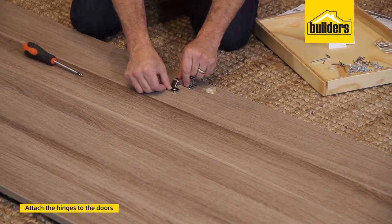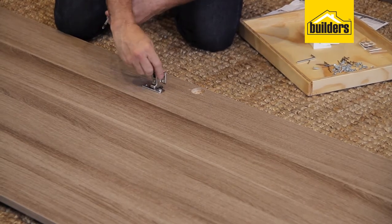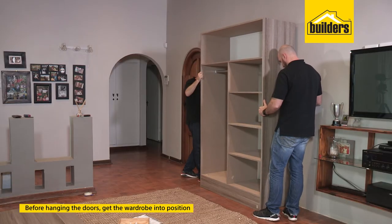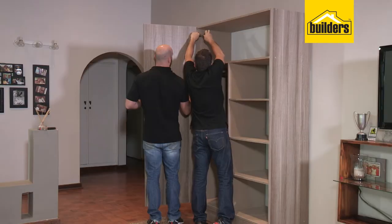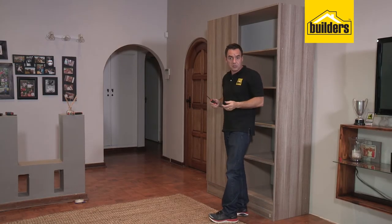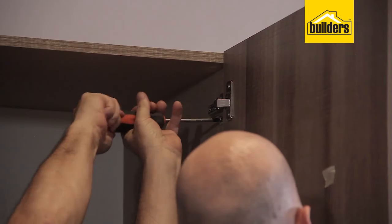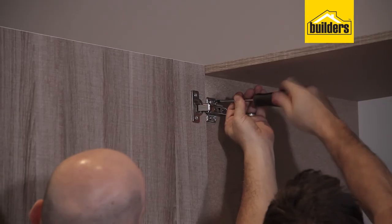It's now time to put on the doors. First, insert the hinges into the doors, pop in the 16-millimeter screws and secure the hinge down tightly. Before putting the doors on, it's a good idea to get the structure into its final location without the excess weight of the doors. Fitting the doors can be quite tricky due to their size and weight — make use of a second person to hold them up into position while you align the screws through the hinges into the pre-drilled holes on the sides. Once the first door is in position, pop on the second door, then align and set your hinges to make sure the doors are square, neat, and flush all the way around.